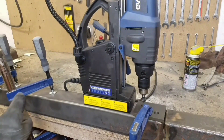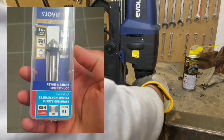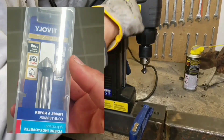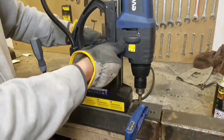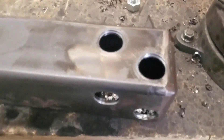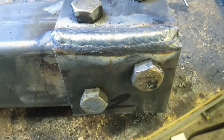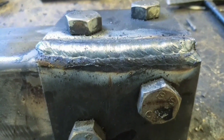As you can see, I used 10mm by 100mm flat bars. I drilled 16mm holes in them because I'll fit 16mm bolts through. To align properly with my magnetic drill, I first use a chamfering bit so I'm sure to be centered, then I drill a small pilot hole to have a real reference mark — to be perfectly aligned. You'll see it later in the video but this Tivoli chamfer bit is really effective. The feet are 80x80mm on 4mm thickness. I drilled the holes just large enough to pass a 16mm nut with plenty of threads so it's very resistant. Once welded in position, I put 4 passes to make it really strong.